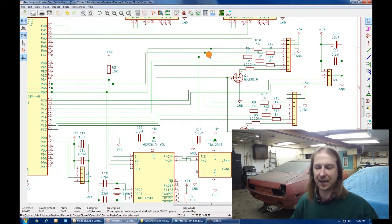Replace the 2 useless warning lights. So these displays are actually pretty easy to control because they're just SPI bus devices. They connect to the same SPI bus as the CAN controller. The only difference is that these devices use 3.3 volt logic, so there has to be a 1K dropping resistor anytime they connect to the output of the Atmel chip.